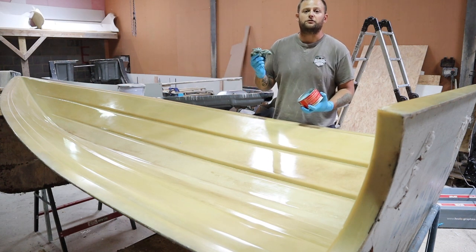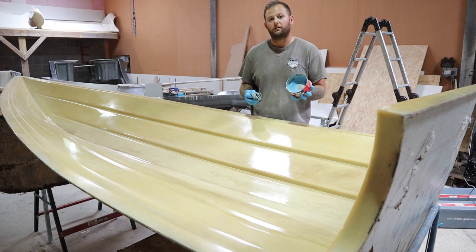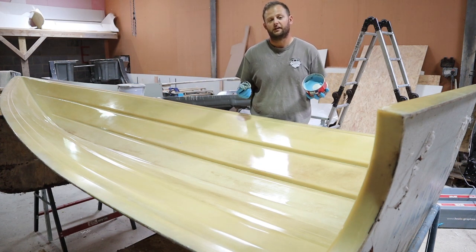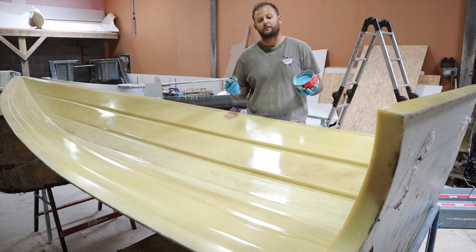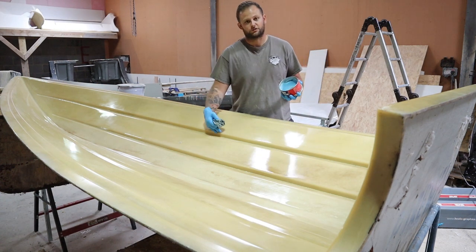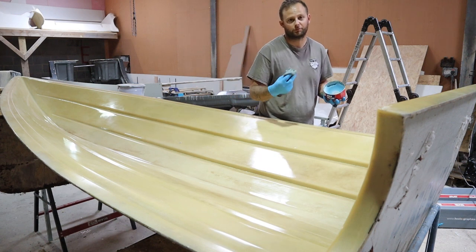Okay, so now I've just got an offcut of a rag that we buy in our large rag bags. Some of these pots come with applicators, they'll be sponge. They last about 2 minutes. They're not the best applicator out there. They may be for nice, flat, easy surfaces, but where we're working on complicated shapes and moulds, such as chines, or we've got these harder edges on the outside of the moulds, they catch and they just break down pretty quickly.